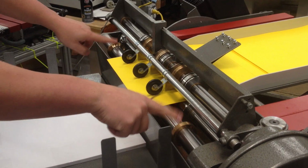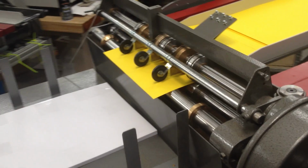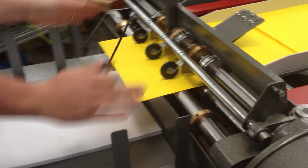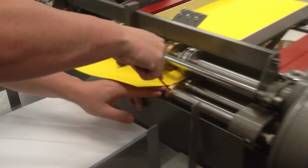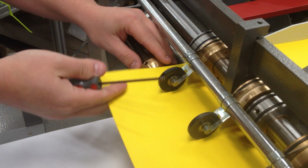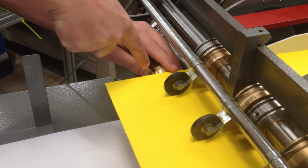And we have one more thing right here. These are page curlers. What they do is they help with the feeding of the paper and make sure the machine can run it smooth. A lot of the times the paper starts to do crazy things when you start perforating it. So what you want to do is just bring them in, just barely touching. Just barely touch, about 1/8 of an inch underneath. They're not necessary, you don't have to use them. They may help you with the feeding.